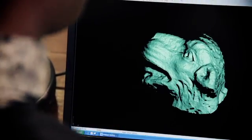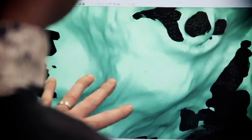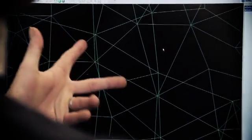You can see the level of detail that this scanner is capable of capturing on a surface. This is called a tinned surface, TIN, which stands for Triangulated Irregular Network. It's basically a series of triangles that are joined together. When we rotate round to the back, we can see all these little triangles that are making up this tinned surface.